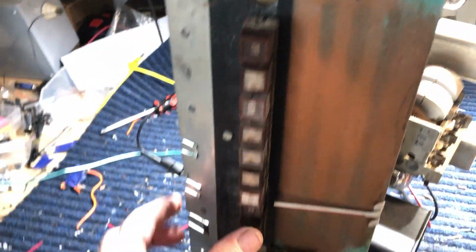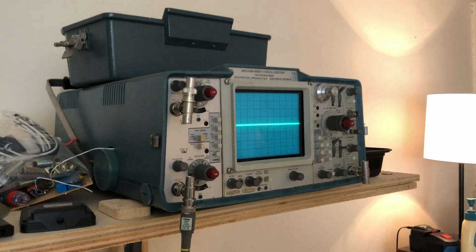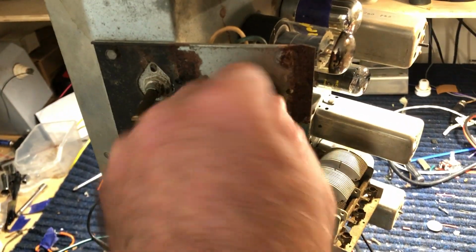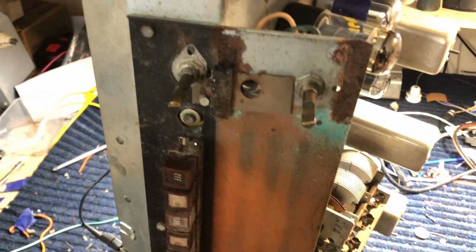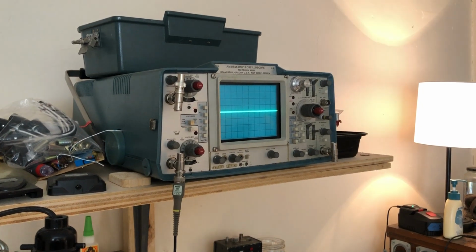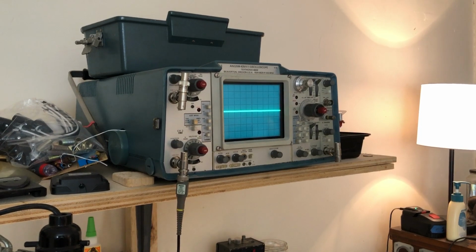For example, this is shortwave. You go to shortwave, you lose the local oscillator. We go to FM. We're hearing a... I don't know where the antenna input is for that, but I don't hear anything on there. So we're assuming that the front end, that turns it off. We're assuming the front end is not working. You gotta work on the front end. But the local oscillator is working, the converter is working, but the RF input is not working.